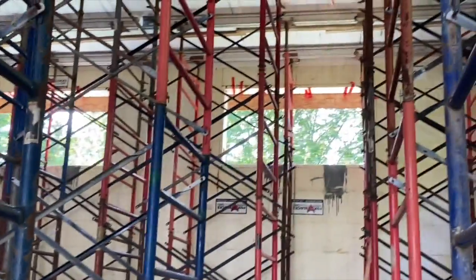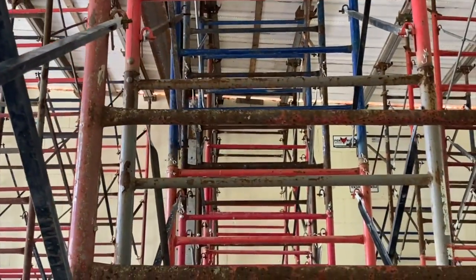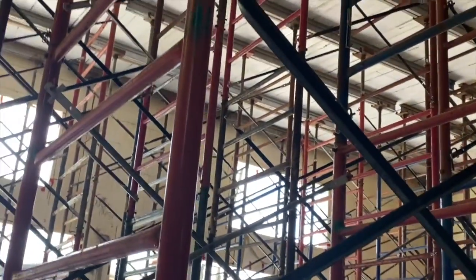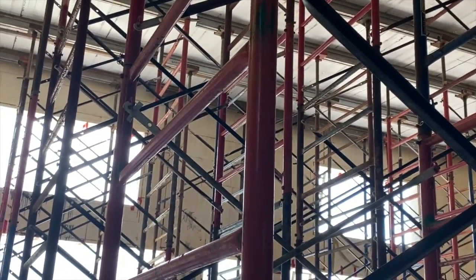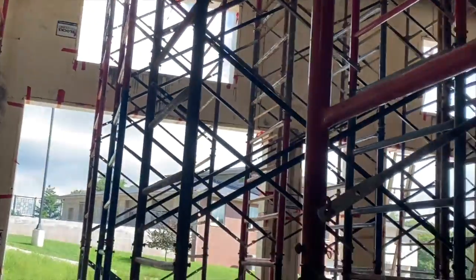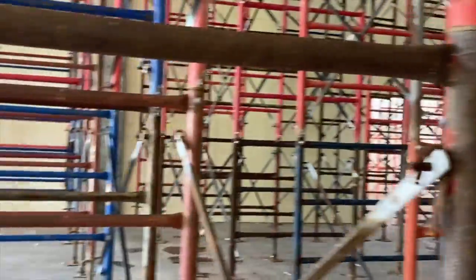But we can twist those up at the top for micro adjustments, basically string line level, or in this case running in a plane, because down here we're about 18 feet tall and we spin all the way over. You can kind of see that that's sloped. If you plane it in with the level scaffolding, you can see that it's running uphill at about a 1 in 12, a little less than a 1 in 12. So we're at 21 feet high over here, so we gained about 3 feet of slope in the length of the run.